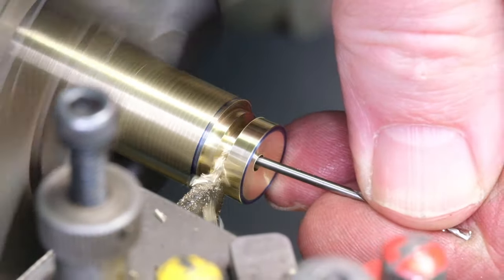With the work on the main clock nearing completion, I gently tap down the burrs on the fusee winding square and modify a new winding key to fit. From stock, these modern winding keys are okay, but they have a parallel broached square hole, which does not match with an historic winding arbor, which tends to be tapered. And also the broached hole isn't deep enough, so using a graver to cut out the inside of the square and a three square file, I make the key a much better fit.